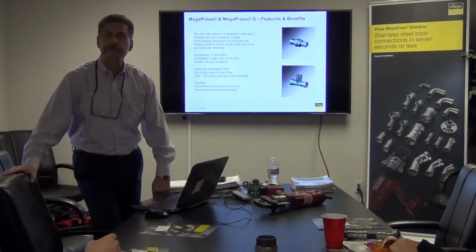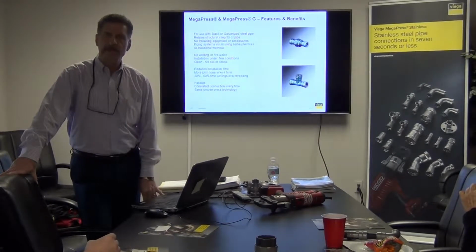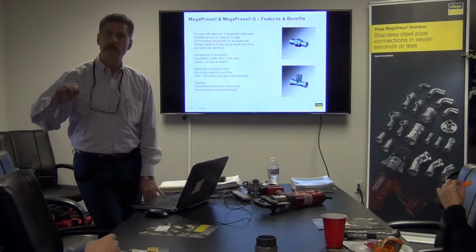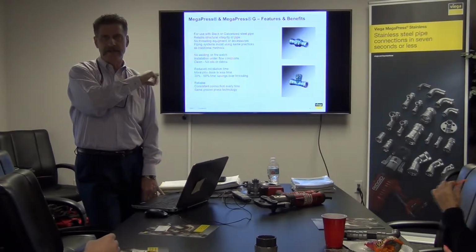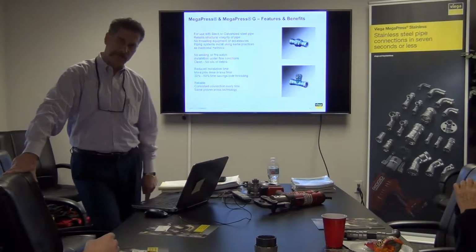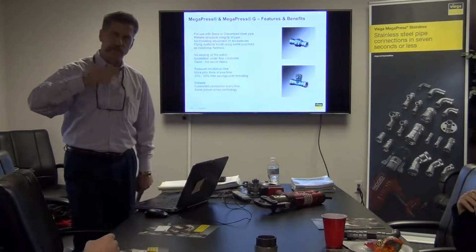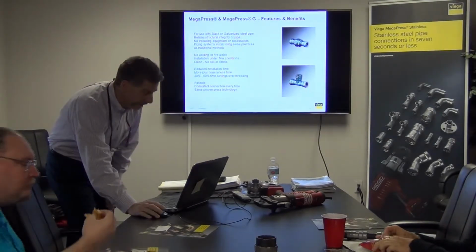Yes, on the pipe that we can use with it, we can use Schedule 5, Schedule 10, Schedule 40, and Schedule 80. Schedule 5 through 40 for up to 2 inches. And then when you go to our MegaPress XL, which incidentally isn't on this slide group, but we'll talk about it because you have the one right there in front of you, that big fitting. But yeah, Schedule 5 through 40 for up to 2 inches, and then obviously 10 through 40 up to 4 inches, the 2.5, 3, and 4. But that was a great question, thank you.